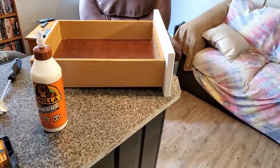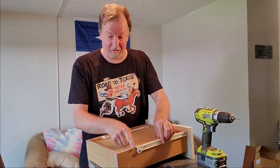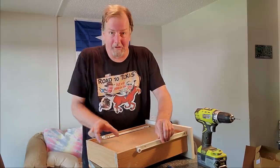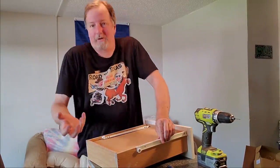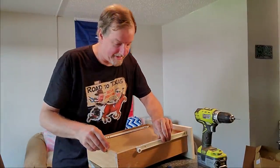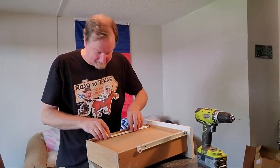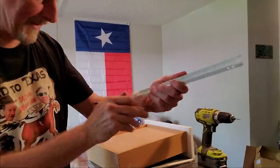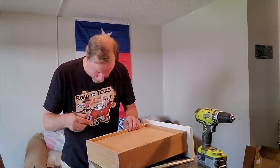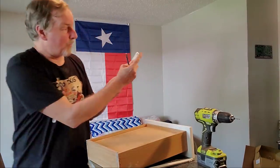Just got to put the sliders back on and put it back in. Ideally at this stage I should go out and buy the proper length rails, because the length of the rails should match the length of the drawer. Right now this drawer is only going to pull out about this far, which means a good portion is going to be hidden inside the cabinet. I'm not going to spend any money on this — I'm just going to try to make it so it doesn't fall apart. I'll put a couple of holes where I want the new screws. You have to keep track of these because there's a left one and a right one — they're usually marked. Right there it says DL, which is drawer left. You always want to push it right up to the front end when you make your holes.